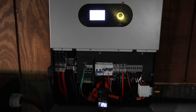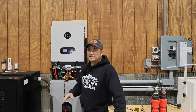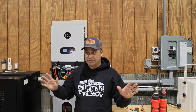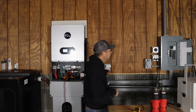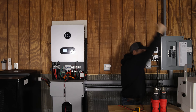And we overdid it — 109.0 amps — the inverter tripped. The inverter is green again, it's reset. To make this a completely fair test I'm going to turn the lights off, leave just a couple small lights on so we can see, and get that 2,100 watts down as low as possible. With all the lights off we're only running 200 watts. The compressor is still plugged in — I just turn the breaker on. And it started!